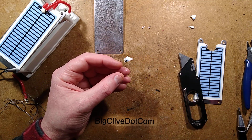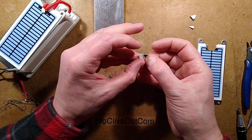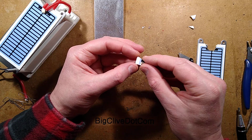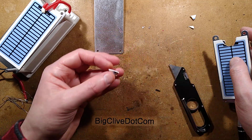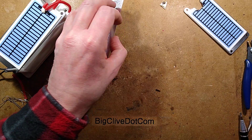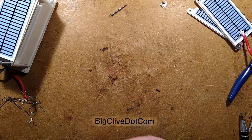There's a separate coating there. I think maybe they've printed a metal coating on, but then put the black stuff over the top of the conductive coating, just as a protection, because ozone is extremely aggressive. It's a mega oxidizer, and it will damage electrodes in short measure. These have probably been optimized over a long period of time.